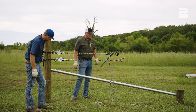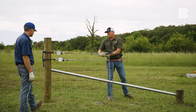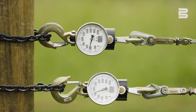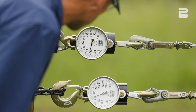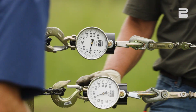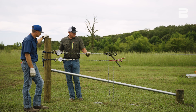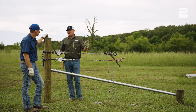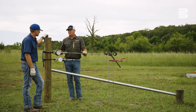Still holding about 400 on the low carbon — that high tensile is outperforming for sure. On the last rotation on the high tensile, we gained about 200 pounds. That pretty much tells me that fence is in the elongation point. And what happens when that fence starts to elongate, it starts to get smaller, it starts to stretch. The next thing that fence is going to do is break.